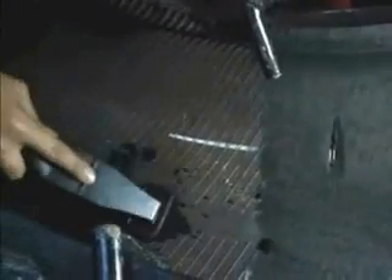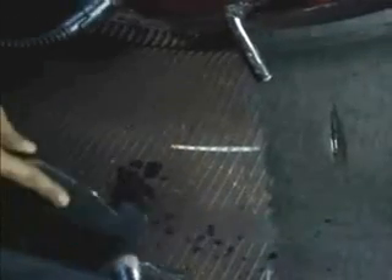The marked area is now buffed using a high grit buffing wheel or wire brush. The finished buff texture should be as smooth as possible with all vent lines completely removed. All buffing dust is removed by vacuum.